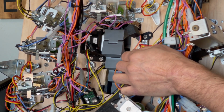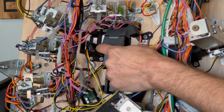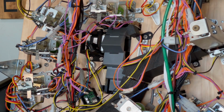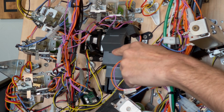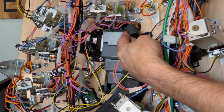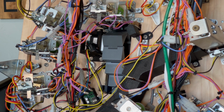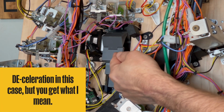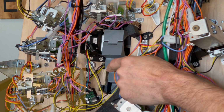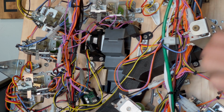So when the stairs start to move, this stair immediately blocks the beam here, okay? And then it continues to be blocked. I don't want my fingers to block it too much, right? It continues to be blocked until this side of the staircase is past this beam, right about there. Now it's not exactly flat because between the parser in the code and the acceleration of the actual stepper motor itself, if I wait and have it not become unblocked until it's perfectly flat, the motor will continue to run just a couple more steps and it'll push it just a little bit further past.